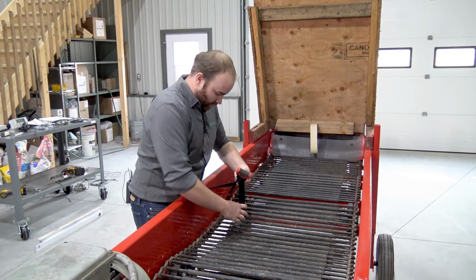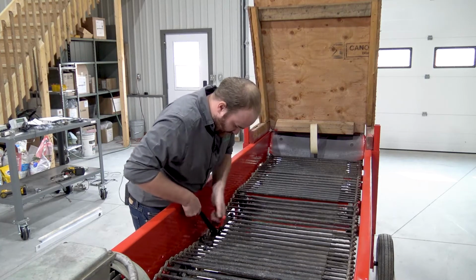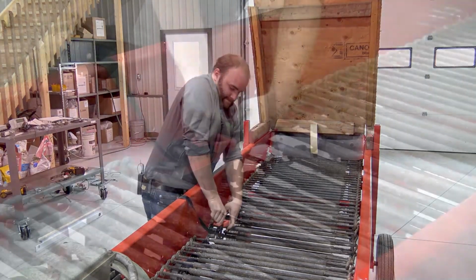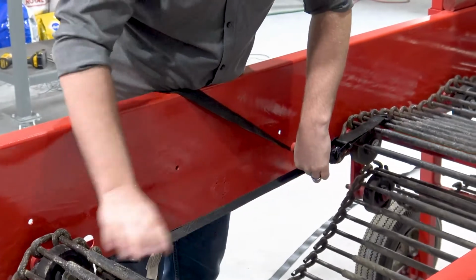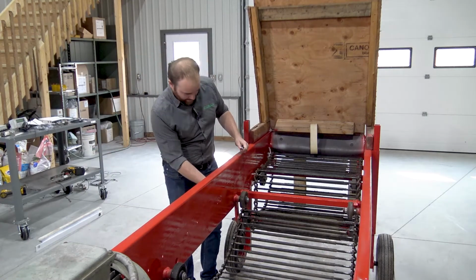The weighing system can be used on solid belt conveyors, where the belt is supported by a continuous slide or on two rollers. It can also be used on belted chain conveyors, supported by individual rollers at the edges of the conveyor. The section of the conveyor in which the load cells will be installed should be supported at both ends. The conveyor does not have to be level, since the calibration steps will account for any tilt of the conveyor.